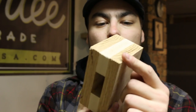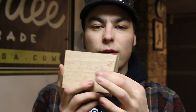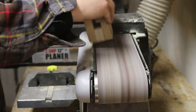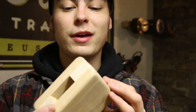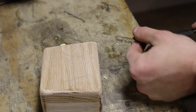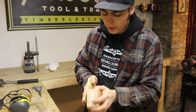The next thing I'm going to do is round over these edges because these are the striking faces - every time I get an angled hit I don't want to have any chip out, so a rounded corner or even a chamfer would be nice. I'm going to go ahead and round these over a little bit just by hand on my belt sander. This is looking pretty sweet - I've got the corners and edges all rounded over on the belt sander. I've got a little bit of glue on the inside so I'm going to just tap that out with a chisel. All good - now I'm going to go ahead and hand sand it a little bit with 100 grit.